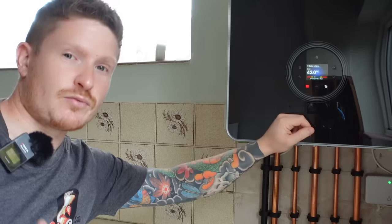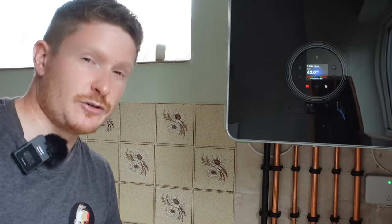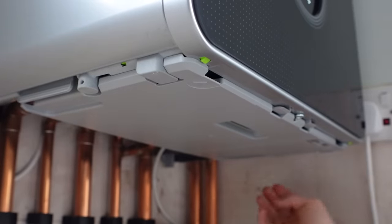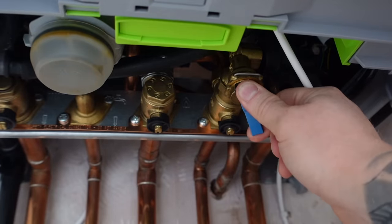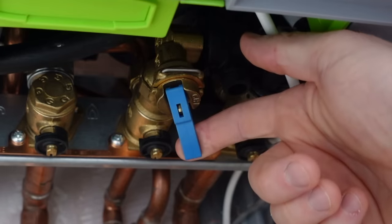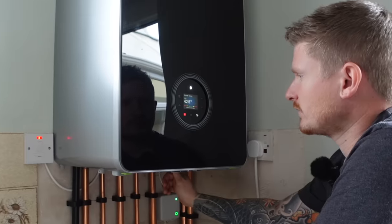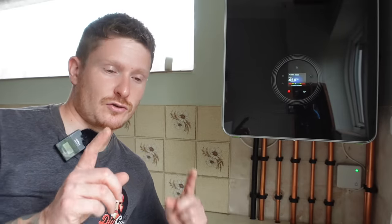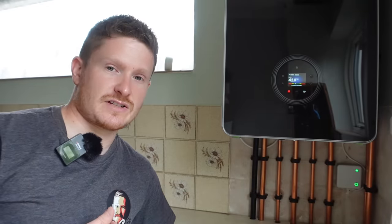You should normally look to have your boiler pressure between one bar and 1.5 bar. If your pressure's too low, you can top it up using the filling loop. There are a couple of different types of filling loop. This boiler has an internal filling loop located underneath the service cover — you're looking for a tap that usually looks something like this. To increase the pressure, simply pull down on the filling loop and you'll hear a hissing sound as water runs into the system. Keep an eye on the pressure gauge until you reach the desired pressure and then let go of the tap. On some boilers you may find a short flexi hose that connects to two isolation taps, and you'd need to turn two taps in sequence to allow water into the system and increase the pressure.